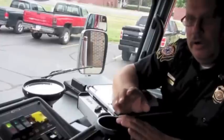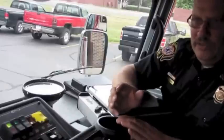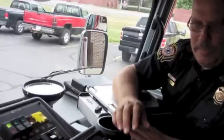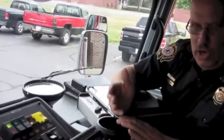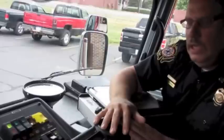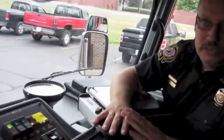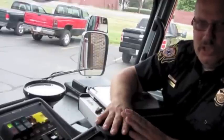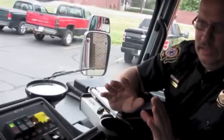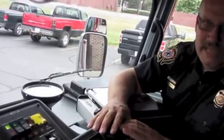The driver now becomes part of the extrication process, whereas before we would have to stop the truck, set the brake, shift the pump into gear, put the truck back into drive, jump out of the truck, go back and retrieve our power unit for extrication and bring that up to the scene, start it — it had its own motor — and then connect the tools. With this, the truck is all set up. It has 200-foot hose reels and the tools are pre-connected, so one or two personnel can start performing extrication within seconds of arrival.